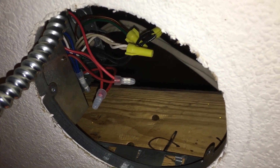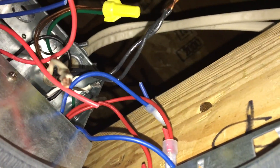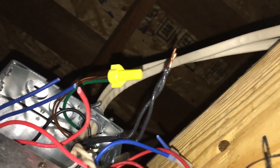All the wires that need to be cut have been cut. You can see the snipped ends - there are two reds and two blues without wire nuts; those are the wires that go into the can. Off to the side I've tucked away the corresponding ones that go to the ballast - we don't care about them but we leave the plastic tips on so bare wires don't stick out. I've also removed the black and white leads going into the ballast so it no longer has power.